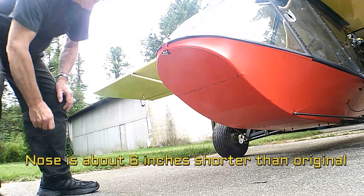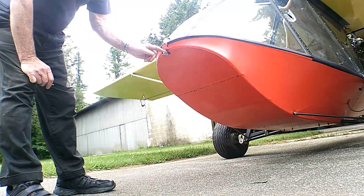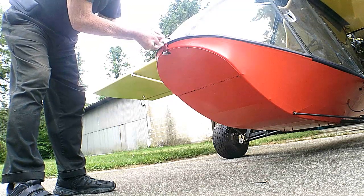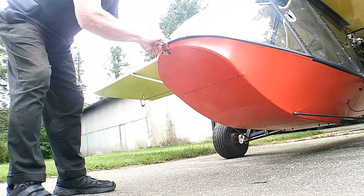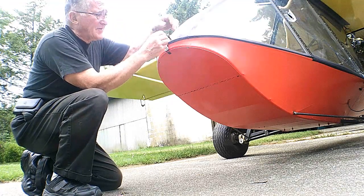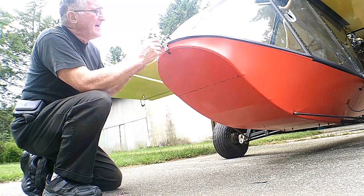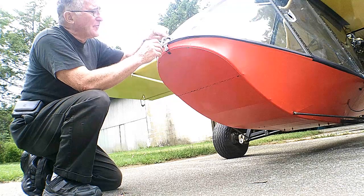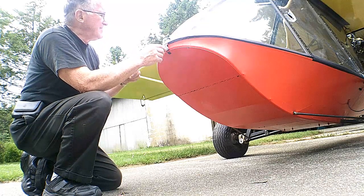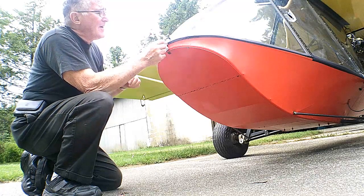One of the things I did was to take a winter pitot tube from a winter airspeed indicator, and I mounted this here with a little plate that clamps it, with just 4 screws that I take out. If I can show you what it is, you can see the bend, how I bent it to get this facing straight ahead when the plane's flying what I think is level anyway. Then the rubber tube goes through the Lexan here to the airspeed indicator, with a T-fitting to take it to the rear seat if I put an airspeed indicator in the rear seat.